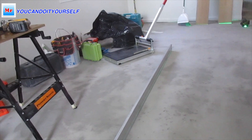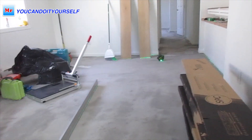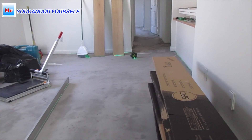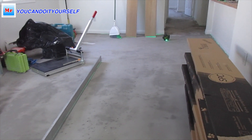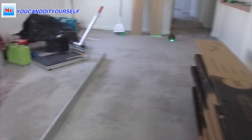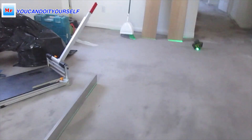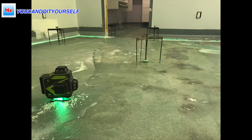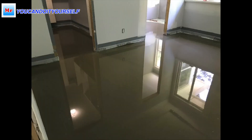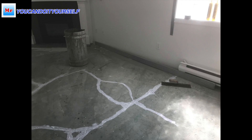What is flat? When a floor can slope down and raise up but doesn't have any humps and low spots. And level? When the floor is parallel with a laser line. This is the simple thing. Here is the example when I did level with special tools called tripods — this is level, exactly parallel with the laser line.